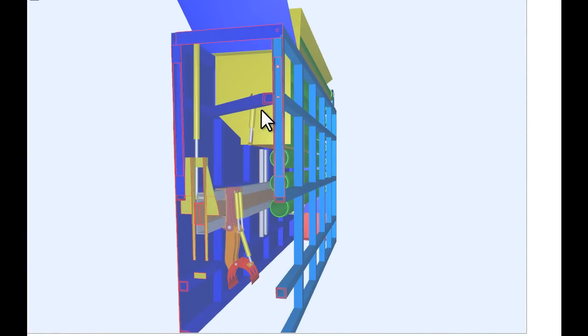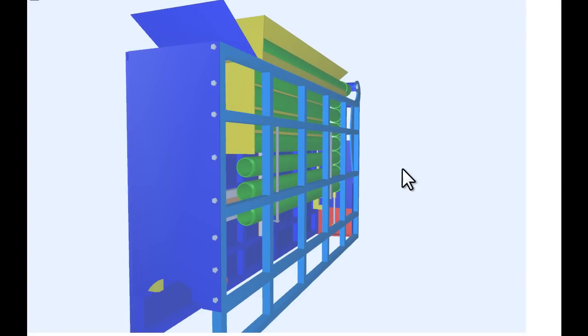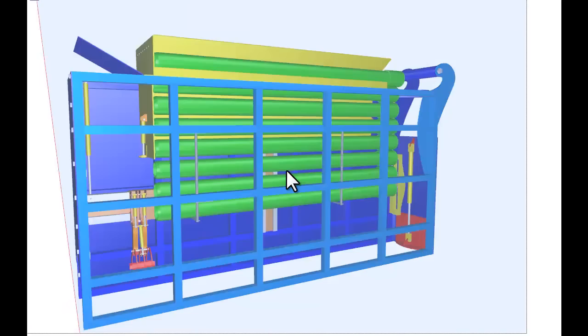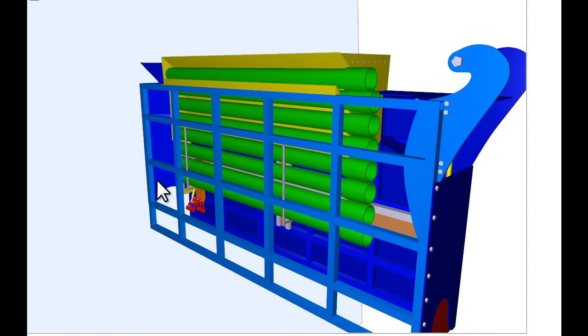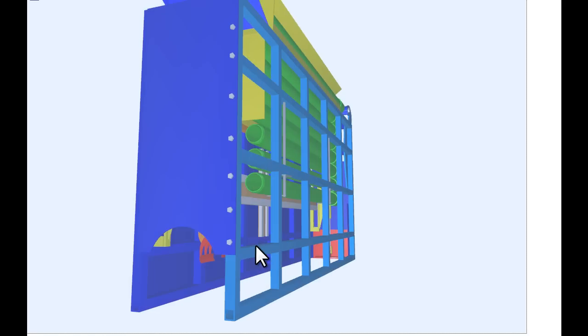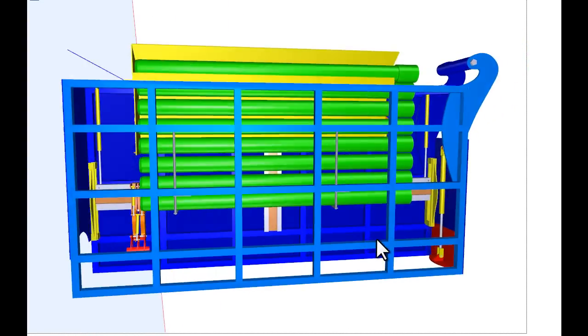You can see the nuts and bolts in this thing across here. You'll see them over here on the end, the sides here, to the supports through the middle, and the cage here. This is so that you can take this piece off the side, this other side of the box, and you can get a kit to extend it wider for bigger than 8-inch pipe. You want to do 16-inch pipe? Well, we add about 10 inches to it, and we set up your dispenser to handle a 16-inch pipe. And these jaws right here on this particular model will handle about 14-inch pipe, but we can very easily make the jaws bigger.